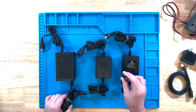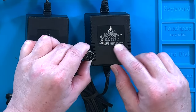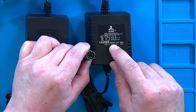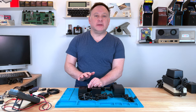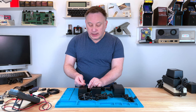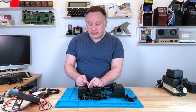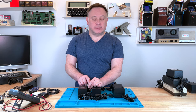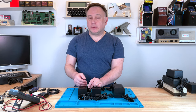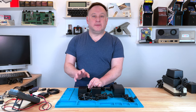These have a 7-pin DIN, round DIN connector. If you take a look inside, it shows that the 5-volt is on pins 4, 1, and 6, and ground is pins 5, 3, and 7. That doesn't mean there are three 5-volt outputs — they just tied all three of those pins together, perhaps for continuity, letting the amperage spread across more of them, or in case of a cold solder joint. But it's just a single output of 5-volt DC.